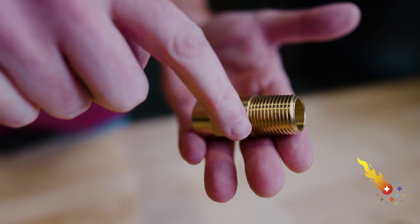The other type of fitting is a tapered fitting called NPT, commonly known as National Pipe Taper, which is a standard for tapered threads. Since NPT has tapered threads, the seal is provided directly by the threads — the tighter you screw the threads in place, the tighter the seal. For NPT fittings, Teflon gas tape is always required. In the U.S. and Canada, Teflon gas tape is colored yellow for easy identification. If you're trying to measure existing NPT sizes, you should know that the size is loosely based on the inside diameter of the pipe and not on the actual thread size. For example, the outside thread diameter for half-inch NPT measures just over three-quarters of an inch, which is the size used for most of our burners and components.